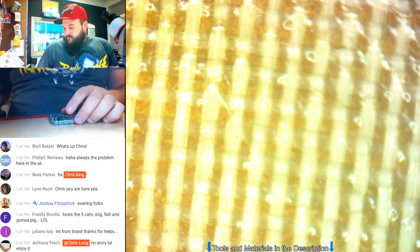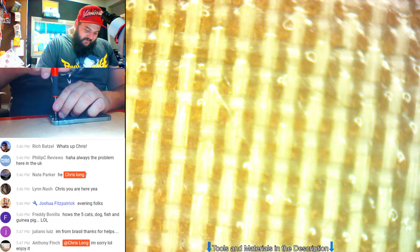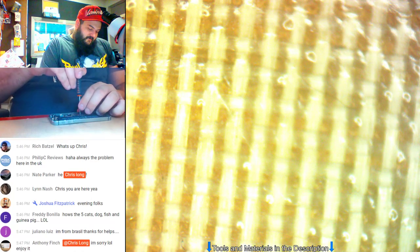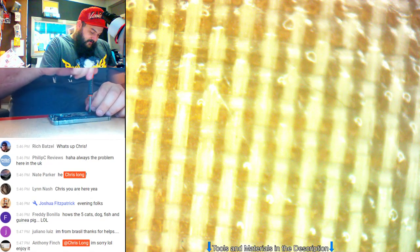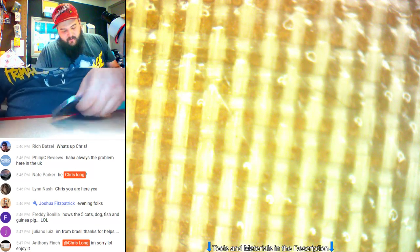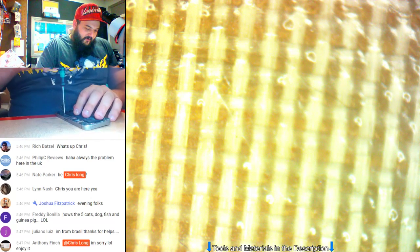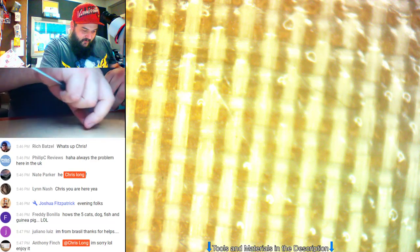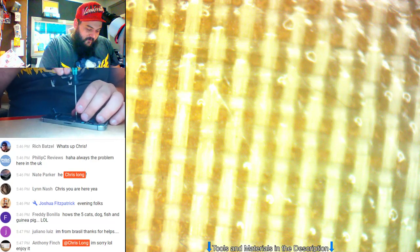So this one was sent in by Anthony in chat. I did a little testing before I started the stream, so I wasn't wasting a bunch of time on stream, since we don't have much time left in the day anyway. The phone will not enter recovery mode. It will go into DFU mode, but it's real finicky to get in DFU mode. And once it is in DFU, when you go to restore the phone, when it comes out of DFU and tries to go into recovery, the USB device becomes unrecognized by the computer.